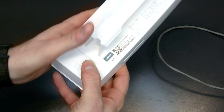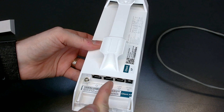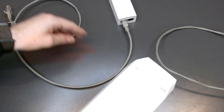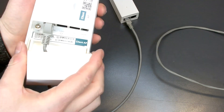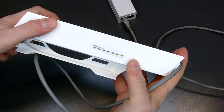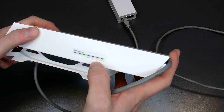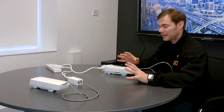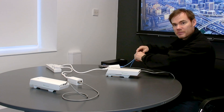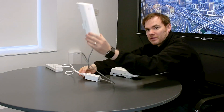Now we've got the client device. If I take the cover off this one, the inside is exactly the same — we've still got our earthing point, our PoE In on LAN 1 port, and two additional LAN ports including the 12-volt power supply. So again, just using a PoE injector, all I've got to do is put that one cable into there and put the cover back on. If we look at the side, we can see the system light coming on. In a moment, we'll also get those lights on the side to indicate it's actually transmitting, as well as the LAN 1 light appearing. This client device is not actually connected physically to my main network.